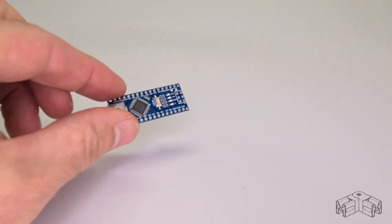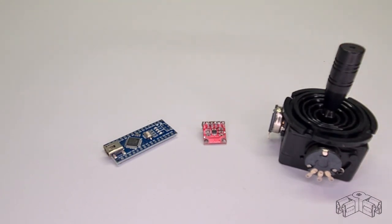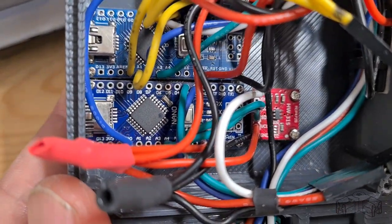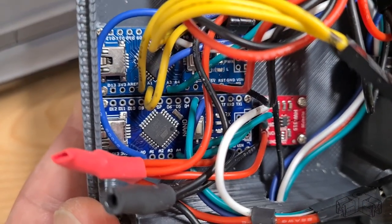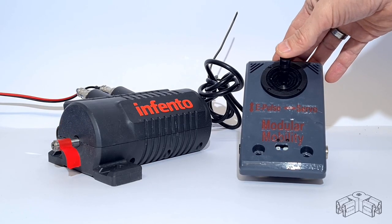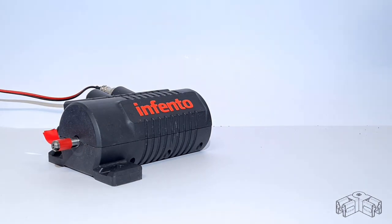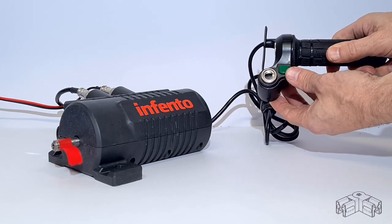I took one Arduino Nano and a 12-bit digital-to-analog converter breakout board, and a joystick of course — this all didn't cost more than 20 euros. My digital-to-analog converter supplies the same analog voltage as the previous throttle grip. My sketch on the Arduino Nano tells it how to do this in relation to the joystick's position. At the same time, the Arduino operates the signal for the reverse direction. When the Arduino circuit is connected to the e-pulse, it doesn't require any extra power supply because it is fed by the same power that normally feeds the throttle grip. I can just replace the e-pulse throttle grip one-for-one with the joystick control unit and back again, whatever fits best.